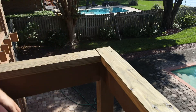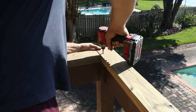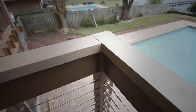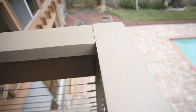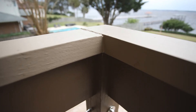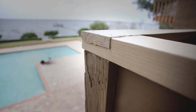I installed three inch stainless steel decking screws and ended up with a nice looking, structurally sound railing cap joint. In my opinion, this is a better option than simply miter cutting the boards for the corner joint, as the half lap joint should hide the effects of wood shrinkage better. I hope you found this video insightful — please share your opinions and preferred joint options when working with wood. Thanks for watching.